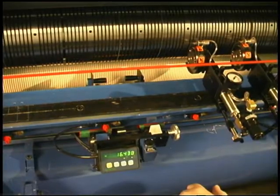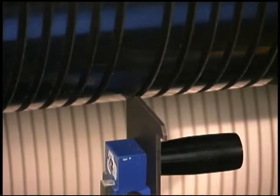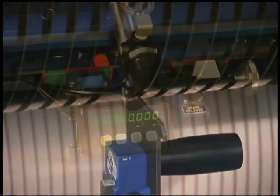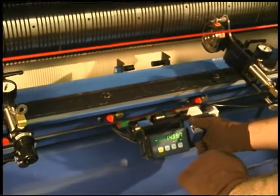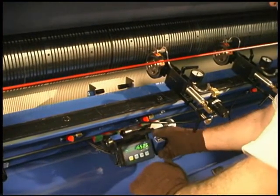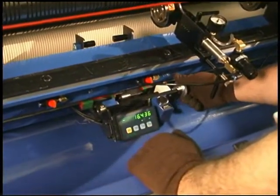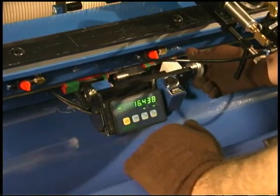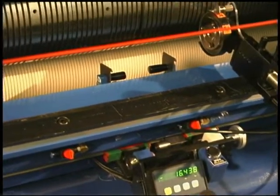There are two knife locators that slide up or down on the knife positioning block. The operator can use either locator arm to set the knives across the web. When the brake release button is pressed and held in, the positioning system can be moved along a track beneath the slitting knives. This will only provide a rough setup position for the knife locator arm. Rotating the knob on the knife positioning system will make fine-tune adjustments.